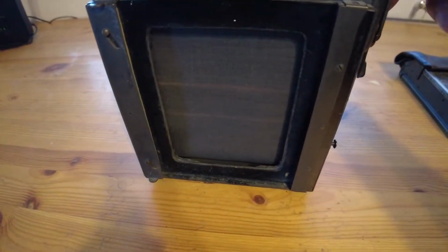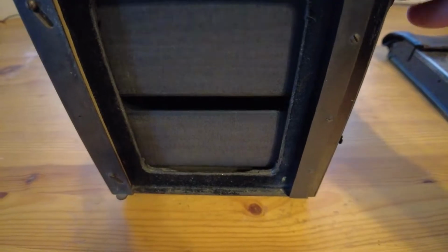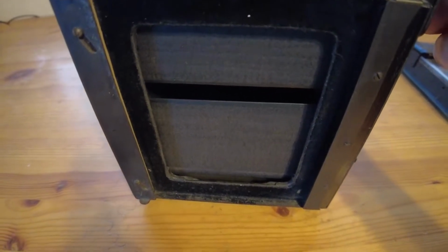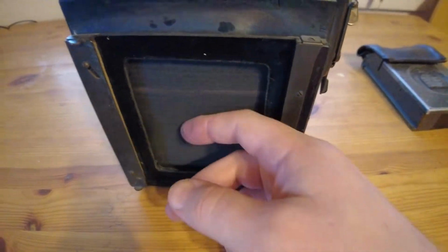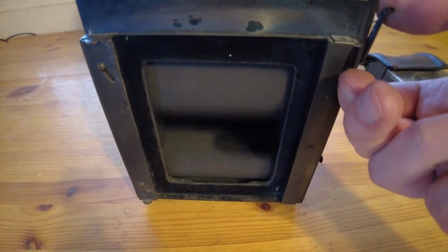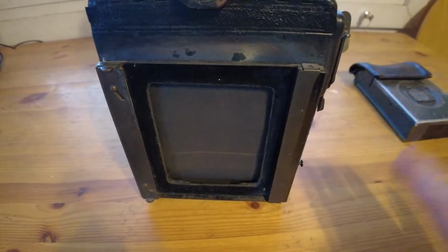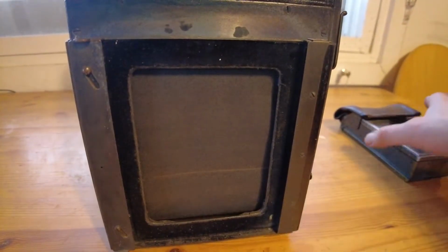Let's again repeat it as we tension. There's the gap, which is a fixed one, unlike in many old European cameras where it's a variable one, which didn't really survive well. And there it is. This one is in absolute perfect condition. Trigger it again. Let's remove the tension from the shutter. Okay, now it's out of tension, so that'll be fine now. Let's put this one back.